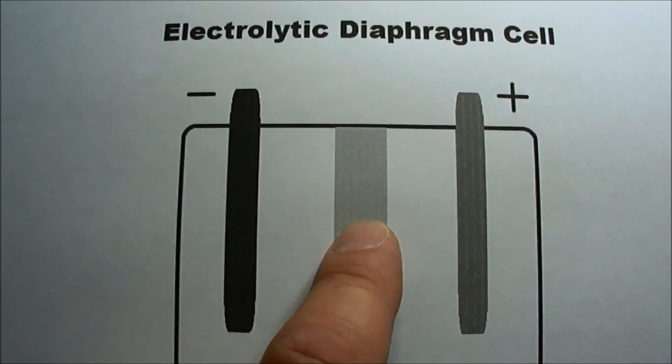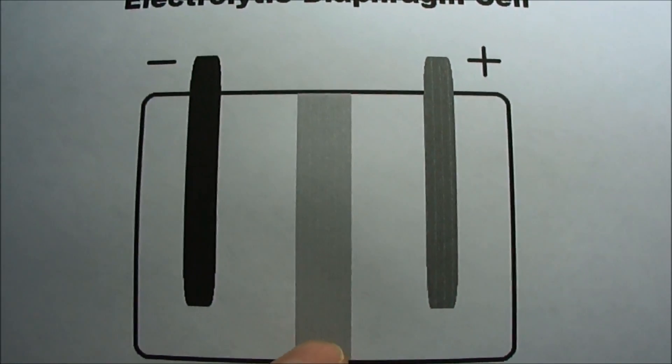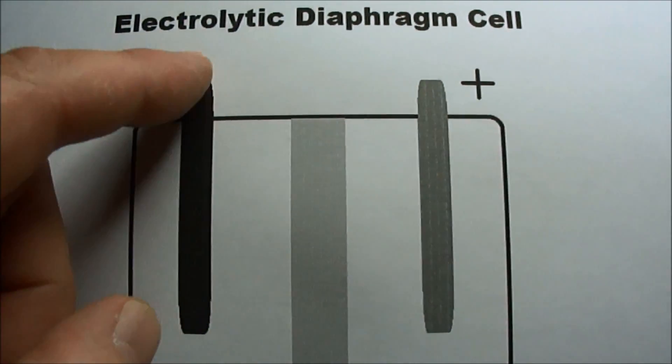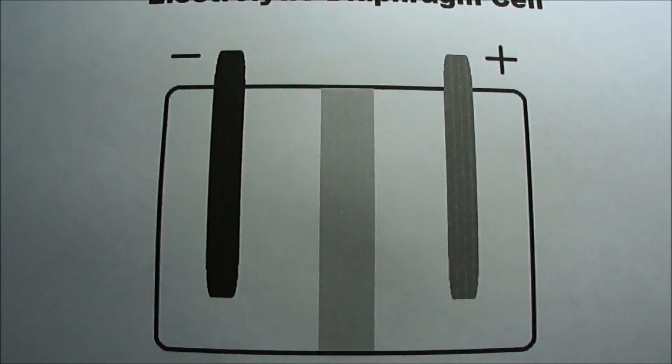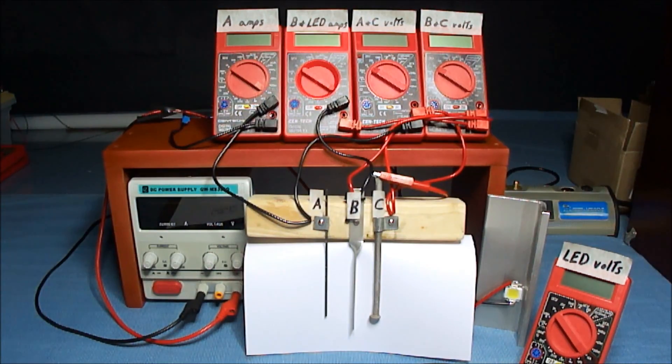What it's used for is to build a neutral point that will build in two different directions. It's going to have trouble building and maintaining that neutral point without another wire connected to it to maintain that neutral zone. What I'm doing is adding a third wire to the center section. What I'm going to be showing here is a plating of copper particles. In a normal cell with two electrodes, you would have the copper on the positive, and the piece you're going to plate on the negative — the deposits would be showing up on the negative electrode.